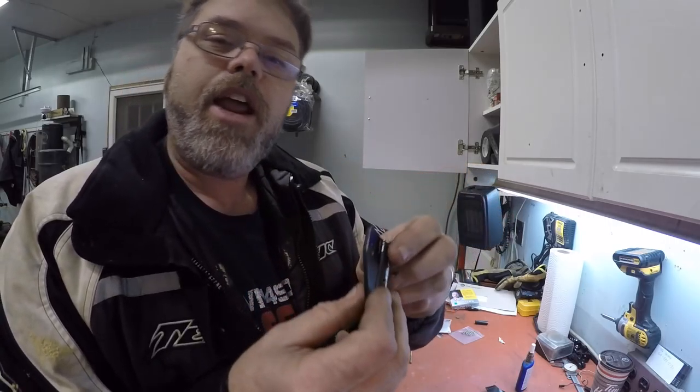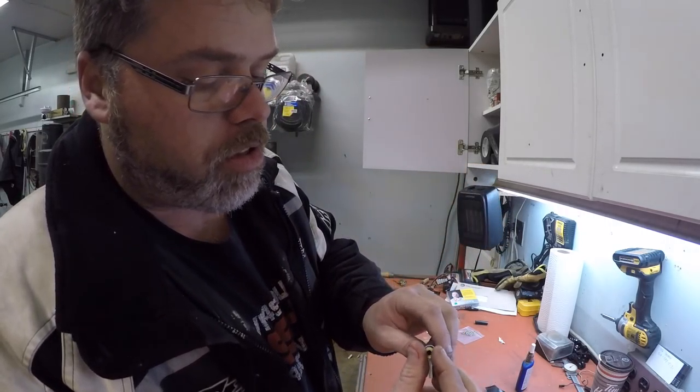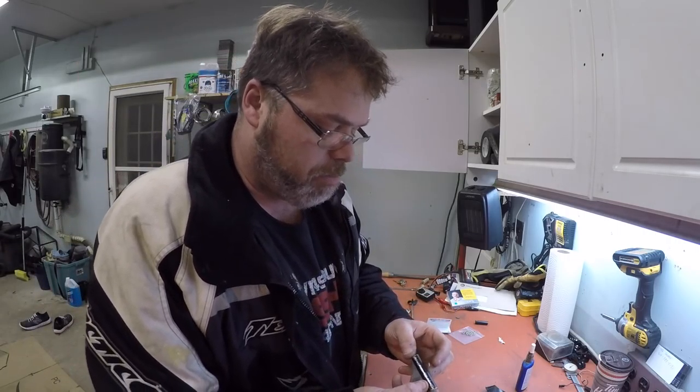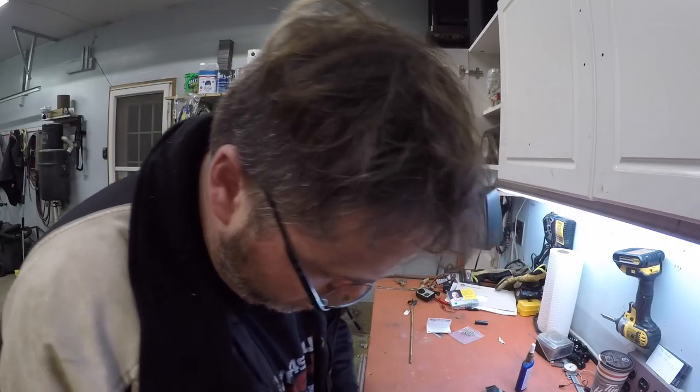So anyways, like I showed you in the other video, I got this thing kind of hand bombed, eh? I don't have a lathe or anything, so I just did a hand bomb job. I'm going to make it so this is bearinged. If you have a Spartan boat and you don't want to spend the money on the ones with the bearings, make your own, boys. Look at that, bearings fit in there a little loose.